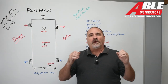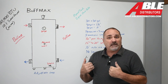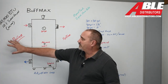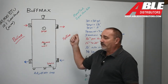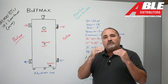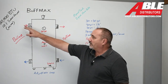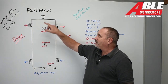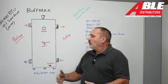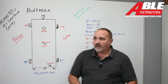What it is is basically a way to store energy, store hot water, use it as you need, and then the boiler replenishes it. So you've got your boiler on this side pumping hot water in. There's a reason we always do the hot water on top — you get better air separation the hotter the water is. So when it comes right out of the boiler, up here is the hottest it is. There's your Caleffi air separator — just makes sense.